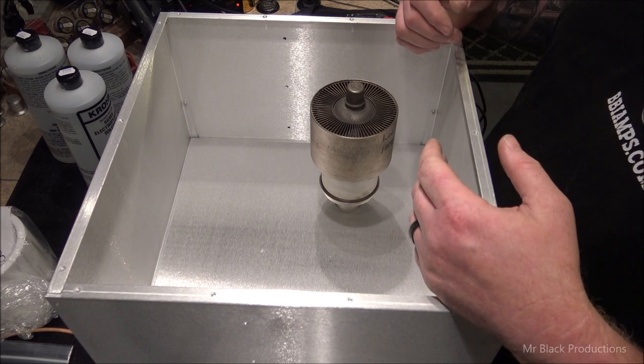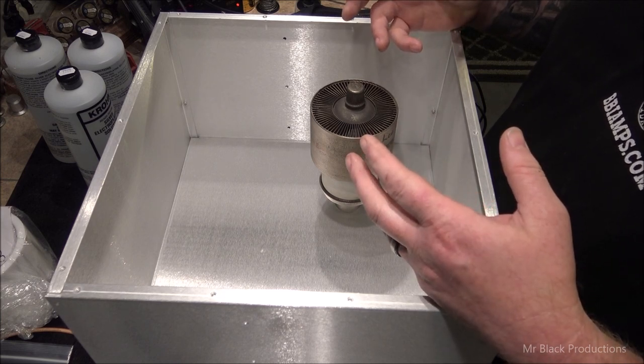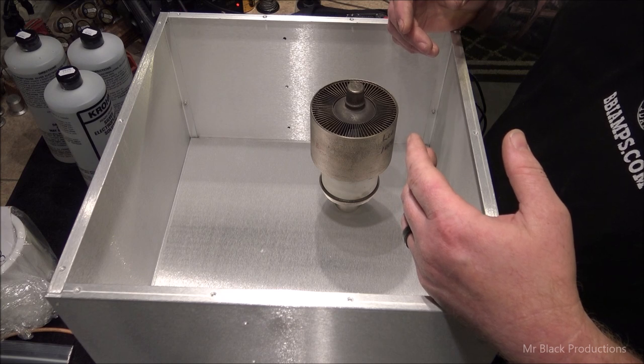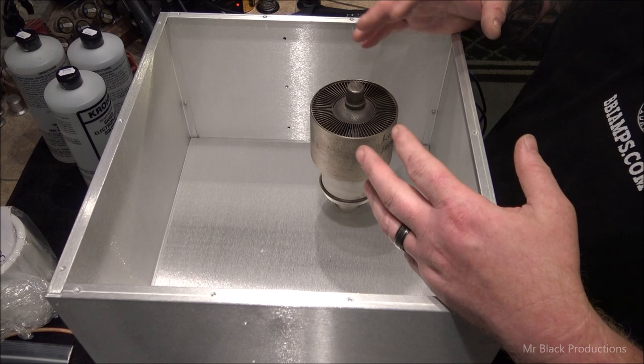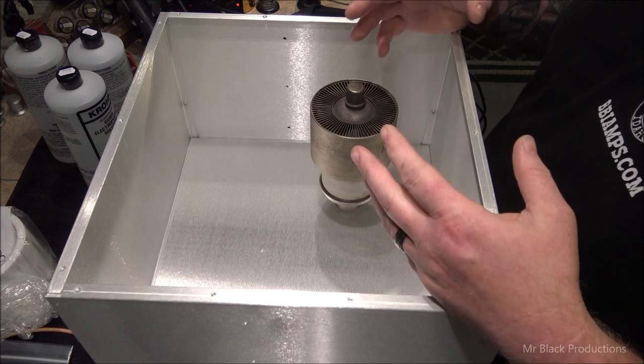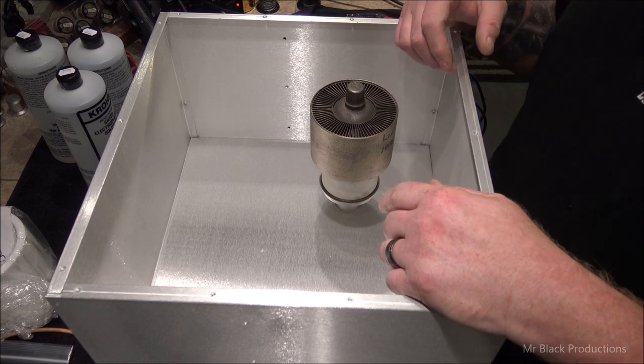I'm like, you've taken this to 80,000? He goes, yeah, we'll take it to 80,000 tomorrow. We took it to 88,000 watts or something. Let everything cool off, high voltage bleed down, opened up the deck, looked inside, no discolorization. I was like, whoa. Mind blown as a young amp builder. Blown, right?